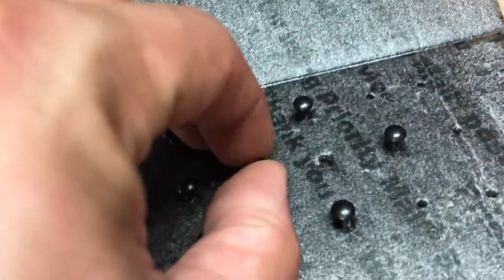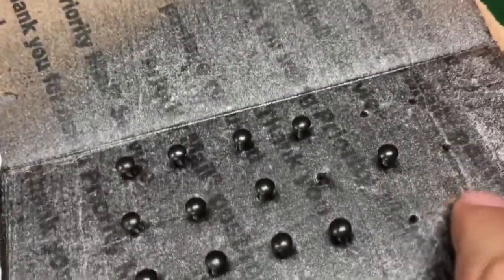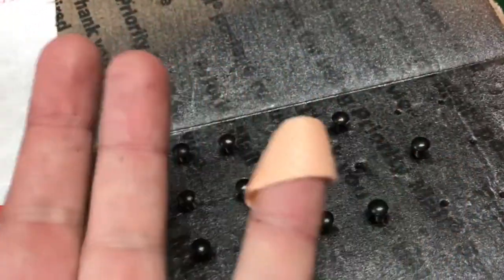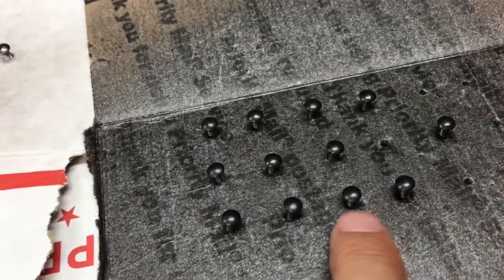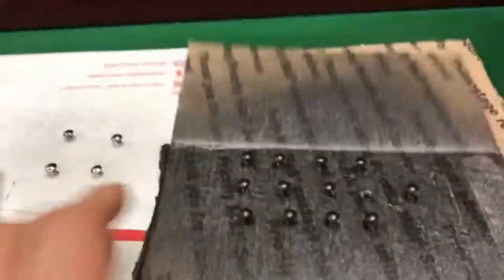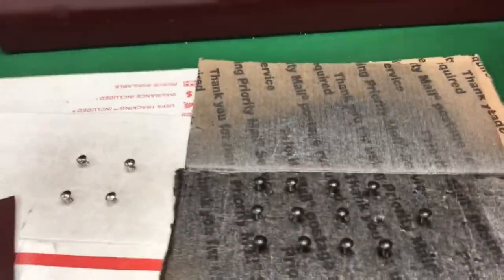If you look at them, they're all stuck in there. Now, to paint little screws like this, just take a piece of cardboard, poke it with a nail — don't poke yourself — and then carefully jam them in there. Make sure their heads are up a bit, and when you spray it, spray from all four angles. I like to do a good enough job so I don't have to do it again. I don't want a lot of buildup on these because they're fasteners.